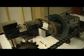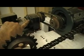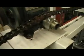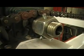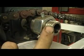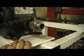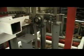Here's the power plant for the pusher. It's a pretty basic DC geared motor — it doesn't go super fast, and that's geared down even more through another gearbox. This gearbox is a 20-to-1 gearbox. It comes out here, and this is a slip clutch in case we hit a big nail in one of those pieces of wood. It won't continuously push the wood into the blade — that would obviously snap the blade — so this is a safety device. The clutch will slip, keeping the wood back and not putting as much force on it.